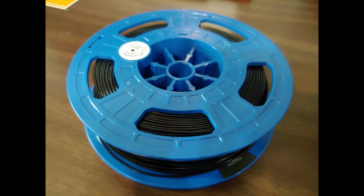I put that stuff in. I did what it said. I cut the filament, and then it told me to insert because it was heated, so I did, and all that. And ever since I put that in, it's not sticking to the build plate. I mean, it is in certain spots, but it's not, and when it starts to lay down filament, it moves a long way from where it should have started, and then starts setting it, like it's trying to set it down, but it's just not sticking for so long, and then there's just a clump of filament. And I don't know what to do. I am really confused on why it's doing that.